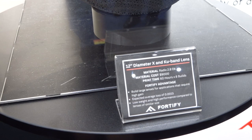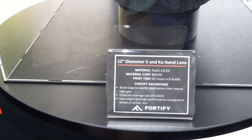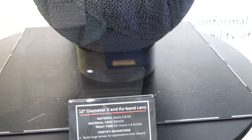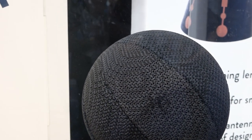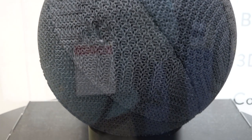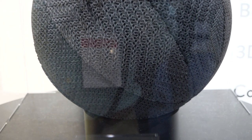This is one of our biggest lens antennas that we've ever made — we think it might be the biggest ever 3D printed. It's a component made out of eight individual pieces glued together, 12 inches in diameter, and it is a 31 dBi gain lens at 30 gigahertz frequency, designed for SATCOM systems.